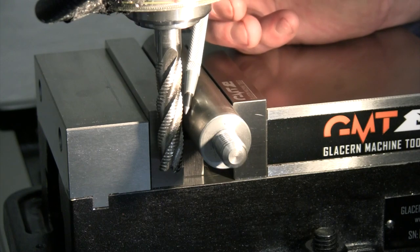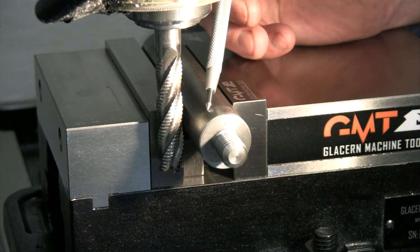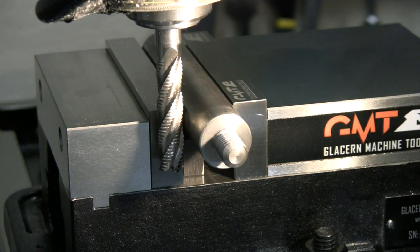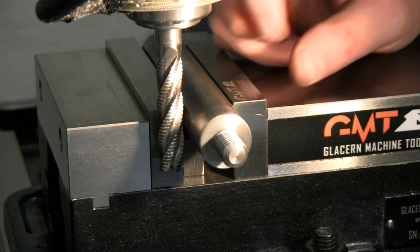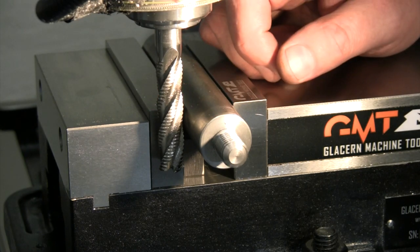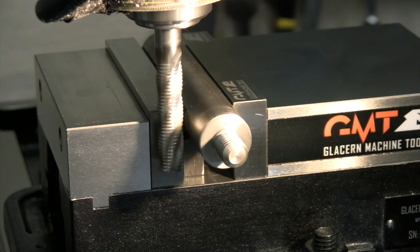So that is the plan. Touch off, move in 1/8 of an inch, cut over 400 thou, come up, get all the way over here 3/4 of an inch wide, and cut the other side. I'm only running at 350 RPM, happens to be where the mill is left right now. I could bump it up to about 500 or 600, but we're just roughing out a quick slot on here, so I think where I have it running should be fine.